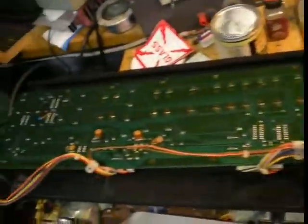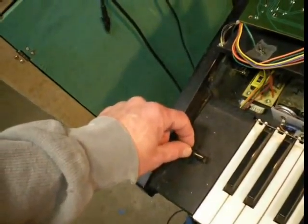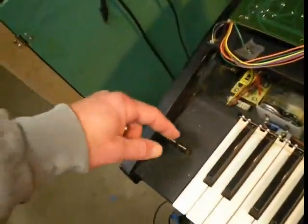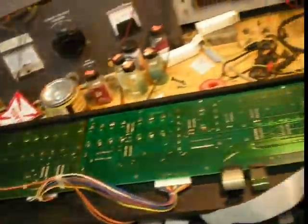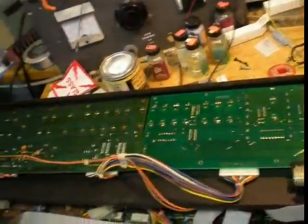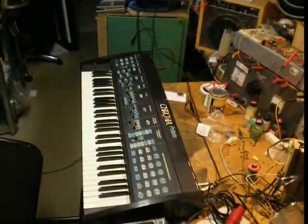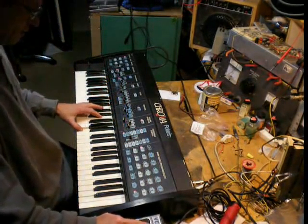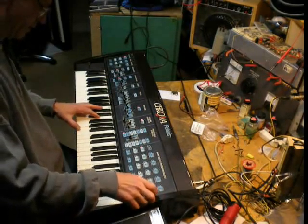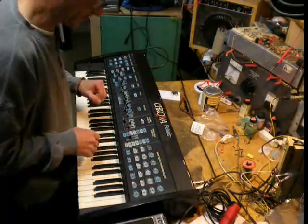And yeah, that is the Chroma Polaris. For the adjustments, you run through adjustment number 7. You go lower function adjustment 7, and then you just move your benders to recalibrate those if that ever goes out. And the 8th, the foot pedal, I think it is, I can't remember, adjustment 8. You can move the foot pedal through its motion the same way, and so you can use arbitrary foot pedals with it, anything that has a continuous resistance. There it is, all back together. Got a little pedal here to move for you though. Pedal's all calibrated.